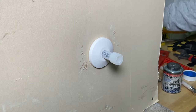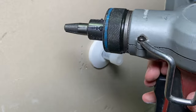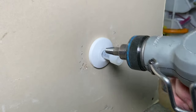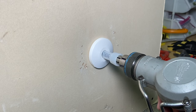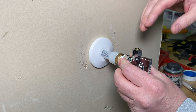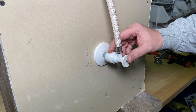We're going to stick it on straight, then pull out our expander tool. This is the Milwaukee M12 Uponor expander tool — these things are awesome. You can rent them at Home Depot these days, and they sell manual-powered ones too, but this one's real easy. Just put it in, give it at least 10 turns, then hold it in place for a minute and get it exactly where you need it — straight up and down, or to the side. This is actually shrinking down on the pipe.